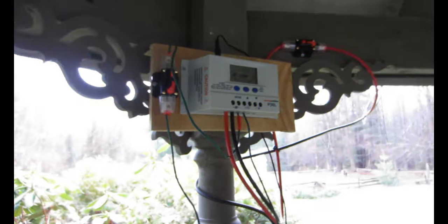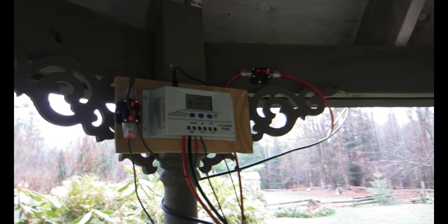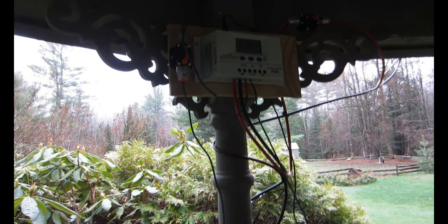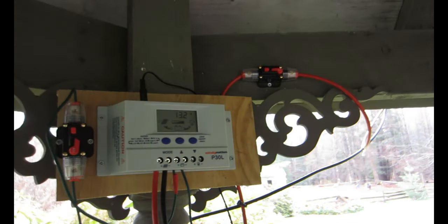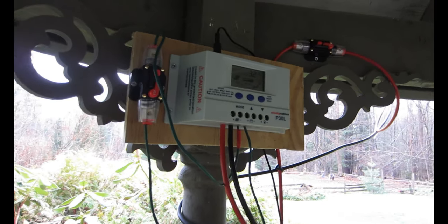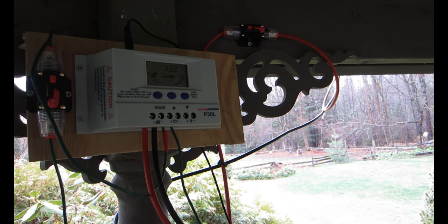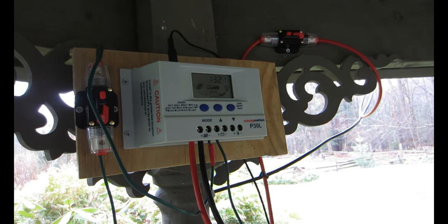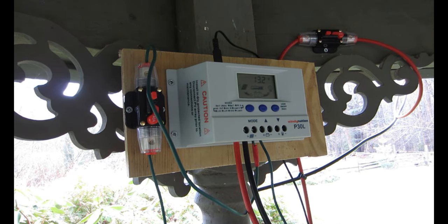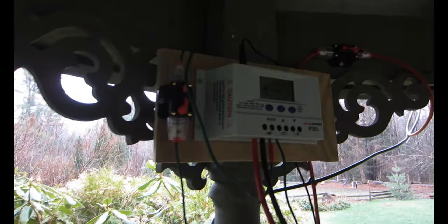That's it — that's the fusing portion of the portable solar generator. You want a fuse between your solar panels coming into the charge controller, and a fuse going down to your battery bank from the charge controller. It's a 30-amp fuse — I have three 5-amp solar panels so a potential of 15 amps. Then I have a 40-amp fuse from the charge controller down to the battery terminal, which is what the P30L controller specifies.